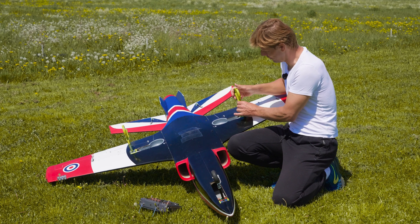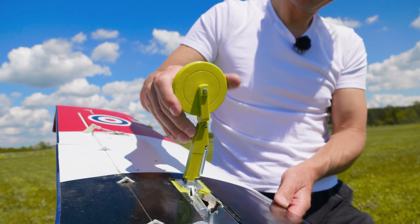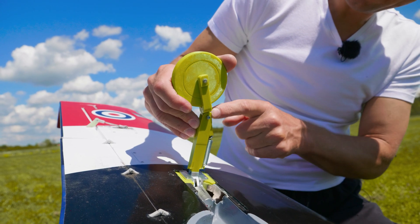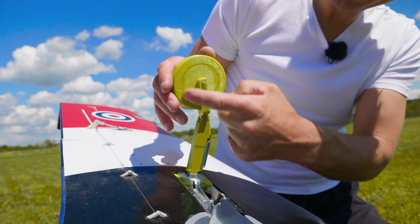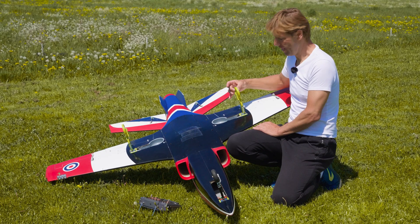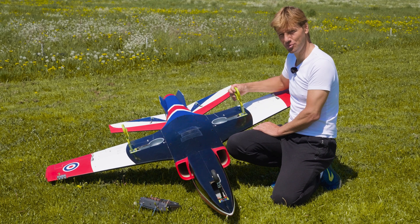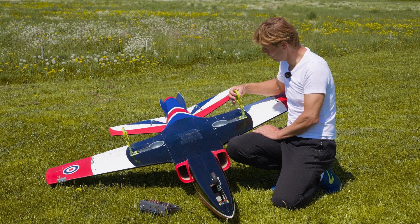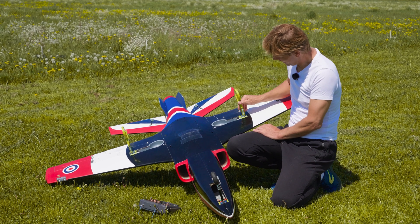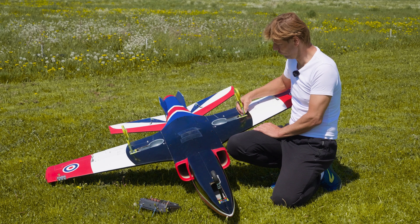This is printed in PLA. I purposefully didn't paint it to show you which PLA I used — for the Odyssey it's exactly the same green PLA, I just painted it with black spray paint and silver on the rim to look cool. But in reality it's just simple PLA. The wheel is single wall, 10% infill, with just the outside perimeter double wall, so it's super thin and light. In Odyssey it worked, and I hope it will work here also.